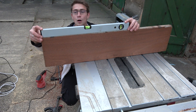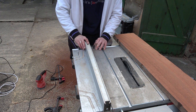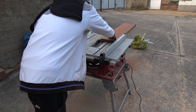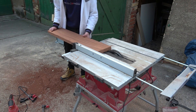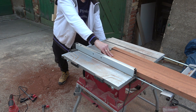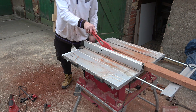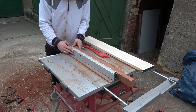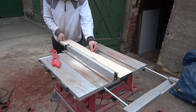One of my mahogany sides already seemed pretty square, so I checked with my level and it was indeed the case. This happy coincidence helped me to get the other side also square with my table saw. After that was done I cut off the rough ends, and then I proceeded to turn my lumber into strips of various different thicknesses. There we go, looking pretty good. Next comes the maple — I used the thickness of my original mahogany board as a guide to get the height of my maple strips right. We've got 5 mahogany strips, so let's fill the gaps with 4 maple ones.